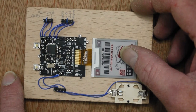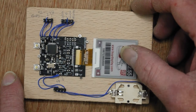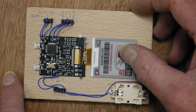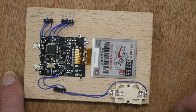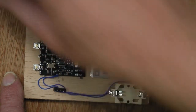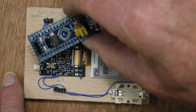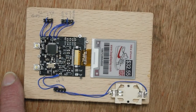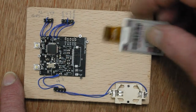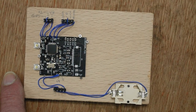They should turn up today, coincidentally, and that's not too difficult a job, soldering that on. It's okay, this board. It's not massively small. Some of the components didn't fit too well, but they're on there. So hopefully, well, the processor, that came off a blue pill, so there's one here with no processor on, and that should program. Actually, I should have a go at putting that on there, put some sort of program on and check that it's working.